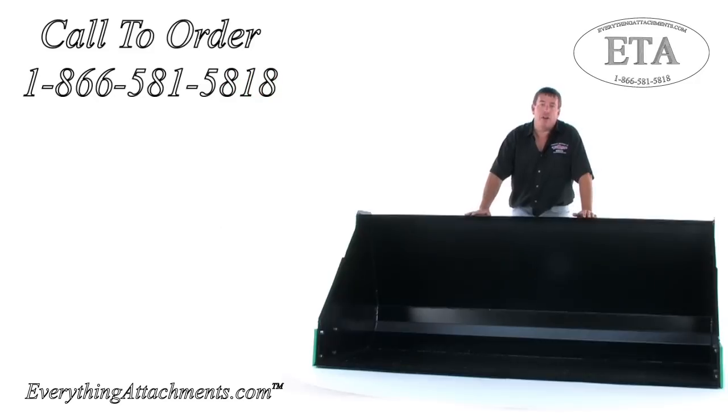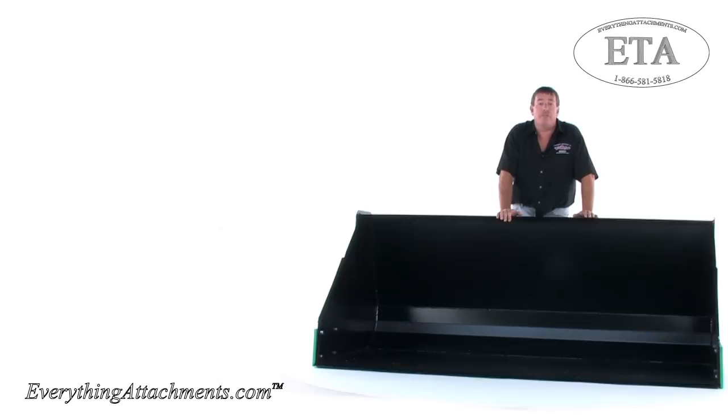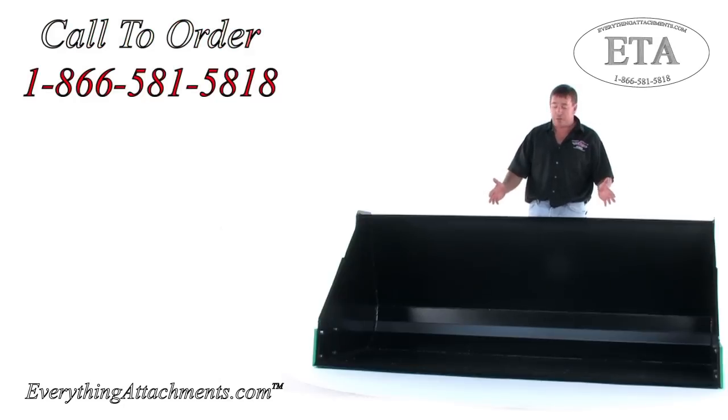This is a high volume bucket meant for light material, usually something like chicken litter. This comes in 3 sizes, a 72, an 84, which is what this is, and a 93. The 72 holds 1 3/8 yards. The 84 holds 1.5 yards, and the 93 holds 1 5/8 yards. Now these buckets are designed specifically for cleaning out chicken houses, but could be used for other things.